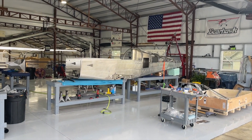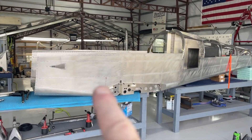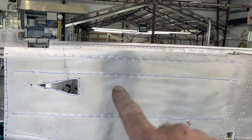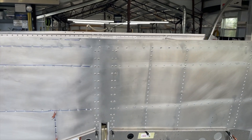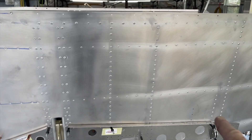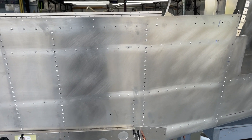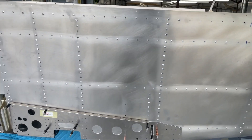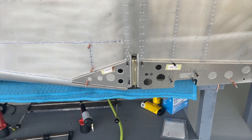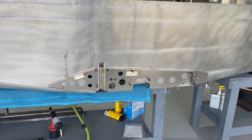I've joined the center fuselage and rear fuselage further with the side skins, and the side skins on the center fuselage are installed and riveted. These are all four millimeter flush rivets at the front, and where the connection is to the carry-through spars in these uprights, these are all four millimeter button heads. Then these are 3.2 millimeter button heads on those stringers that continue all the way down the fuselage. There are plates on here for where the wing insert goes — I used them as a reference to make sure I didn't run rivets into that area, so when I put those plates on, I don't have to drill out any rivets.